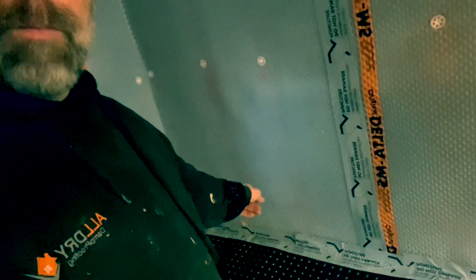So this has been curtain hung. I said these ones have been fixed, so you can dry line to them, so you've got quite a few fixings in. These have been curtain hung, so fixing at top, fixing at middle, fixings at bottom. You try to put as few fixings as possible into retaining walls, especially because water were coming through there. When I drilled one for plugs yesterday, as soon as I put it in, I must have hit a joint and water just come gushing out.